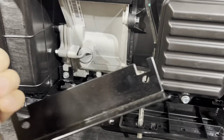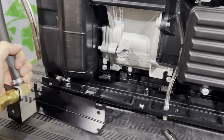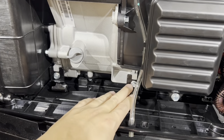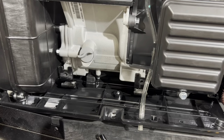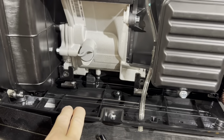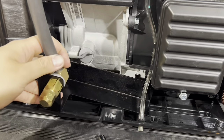Next, we're gonna take our fuel adapter hose assembly with bracket, and we're gonna bolt it in here, and we're gonna remove these bolts from the engine mount, okay? And with our 8mm ratchet, I went ahead and removed the 2 8mm bolts. You'll notice that the engine mount is moving. That's okay. We'll go ahead now, we're gonna put our brackets in.